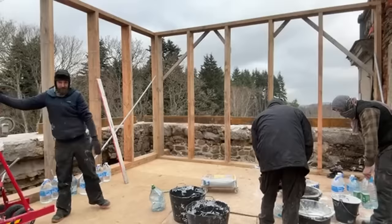There we go. Right, so hopefully you can see what I'm doing now. Yeah, okay. So a line of plaster and then back buttering the beam as well, so it just has really full contact here. Yeah, and it'll sit the beam really nicely.